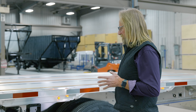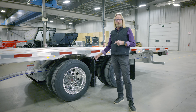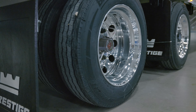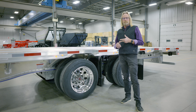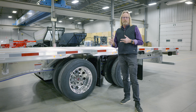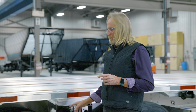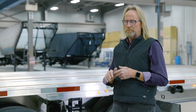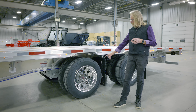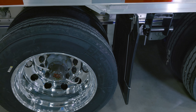This particular trailer has also been equipped with the Tire Max Pro inflate/deflate system, allowing you to maintain and preset tire pressure. The great part about the Tire Max Pro is it does have a deflate feature — should you be over-inflating your tires, it will automatically dump air to get to that optimum tire pressure. Every axle has the Tire Max Pro system built into it. Oil is added in the hub of this unit; there is no plug in the end, giving you full sight of the oil level in your hubcap.